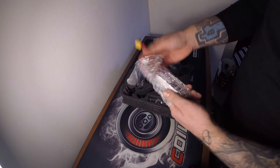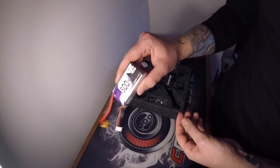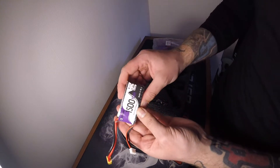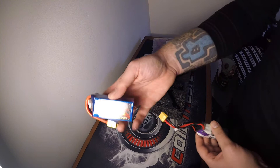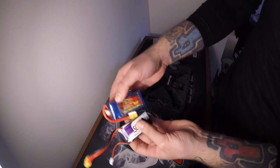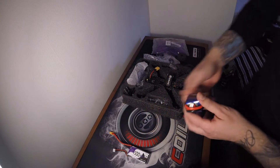Let's go through the battery. So this comes with a 3S battery, 1,500 milliamps. I'd go straight onto 4S guys if you're going to have a bit of fun. If you're a beginner this might be alright because it won't be as quick. What I would recommend is a 4S 1,300 milliamp battery — you can see it's very much twice the size. It's going to put so much more power into the quad. But yeah, you've got a free battery just to start with.